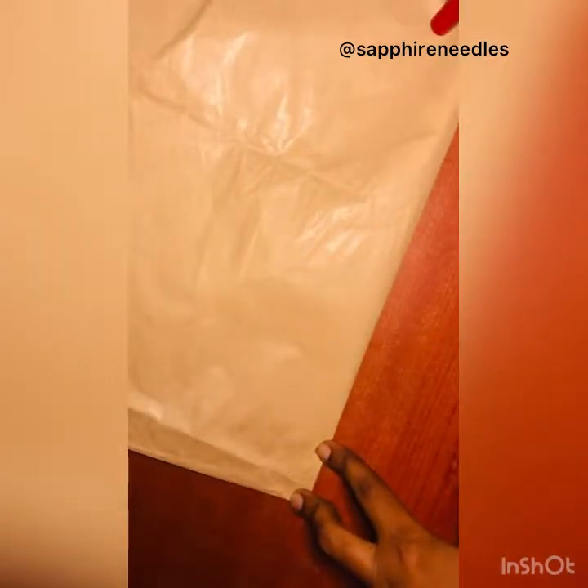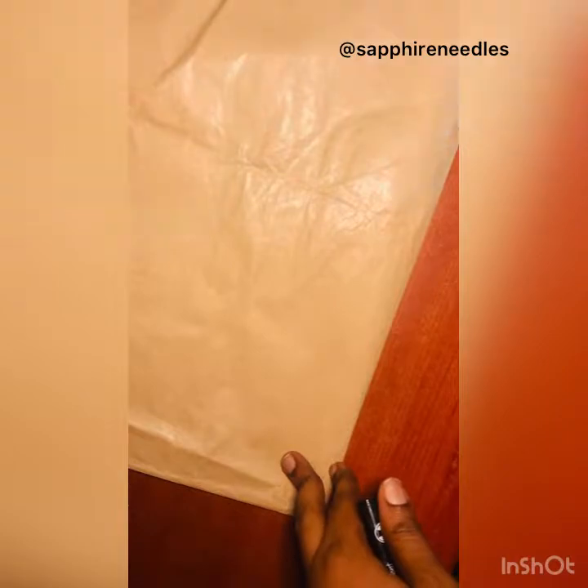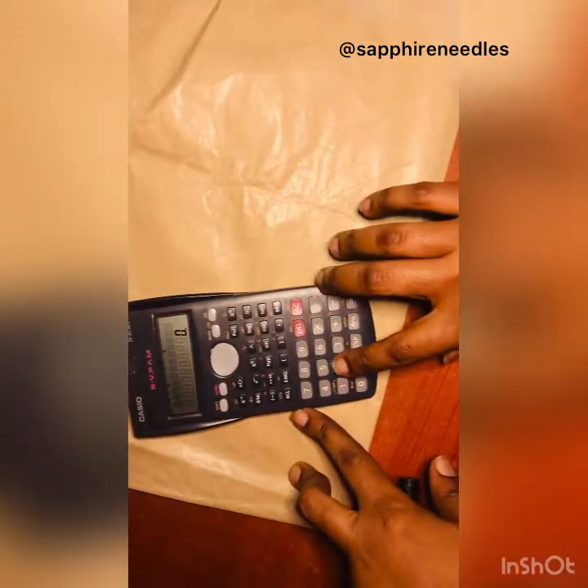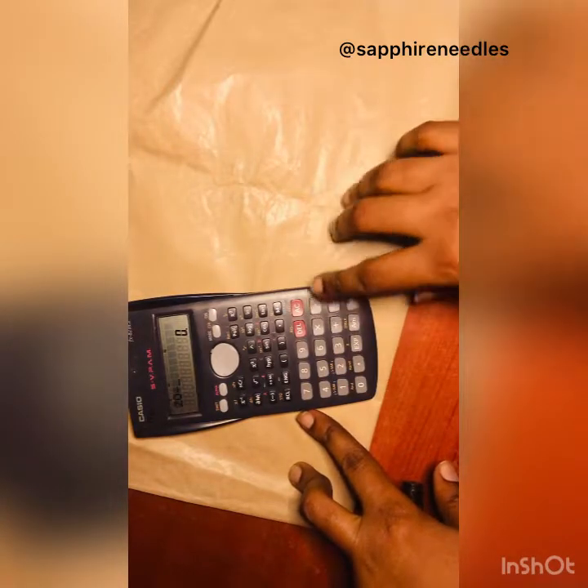At this point is where I'm going to be getting my radius for the 360 degree flare. To get the radius, we divide our circumference by two pi. Pi is 3.14, so two pi is 6.28. For the purpose of this tutorial, let's say the circumference is 20, so 20 divided by 6.28 is 3.1. That's the radius for a 360 degree flare.